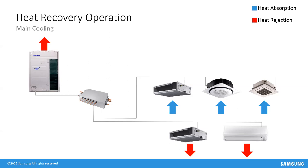A question came in: is there a difference between VRV and VRF? Absolutely no difference, other than that 'Brand D' — Daikin — were the innovators and called it VRV, Variable Refrigerant Volume, which is the same thing as Variable Refrigerant Flow. Two different names: one's a trademark, one's a common industry term.